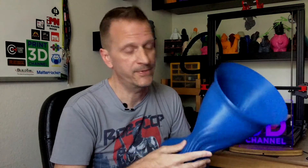There are no blobs, no globs, no layer shifts or layer skips, and no sign of under extrusion whatsoever. This is a very cool looking vase. I definitely wanted to GMAX size it, but as soon as I dropped it on the print bed I saw it was already about 300 millimeters, so I just added another 50 millimeters to make it 350 millimeters tall — more of a GMAX size print. I'll put the link down in the description so you can download and print this yourself. It really does look like flowing water, and I think with the right amount of perimeters and maybe even a little larger, this would be a very functional item.